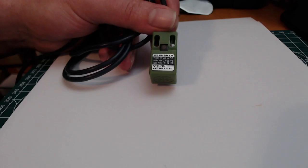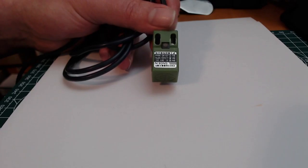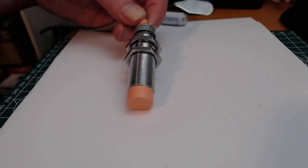This is one of the first auto bed leveling sensors I was working with. It came with my printer a few years ago. The working principle is an inductive sensor, which means it induces a magnetic field in the hotbed below. That means there will be a current in the heat bed producing another magnetic field which will be sensed by the sensor. The problem with these sensors is they work only very close to a metal hotbed — as soon as you use a glass sheet between the metal heat bed and your print surface, they are not very reliable.